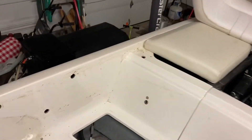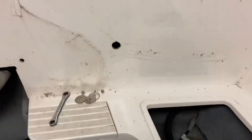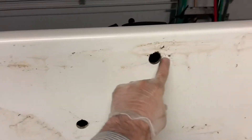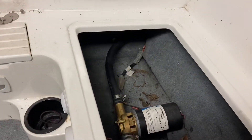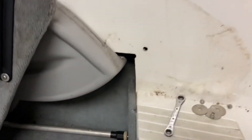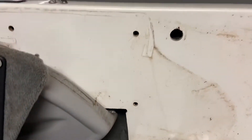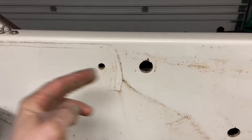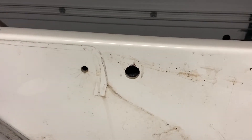We'll start over here on the starboard side. You've got these three bolts — one here, here, and here. For these two, I went through here where the ballast pump is. For this one over here, I found better luck getting up through this opening, but even there it's really tight because you've got cables running here — both your steering cable and different wires.